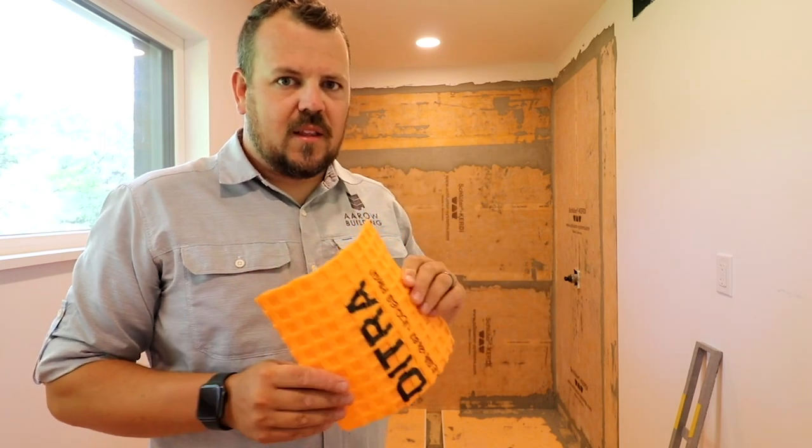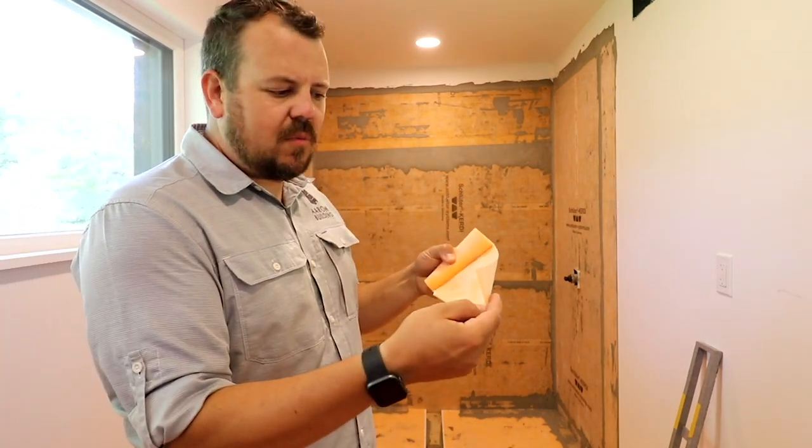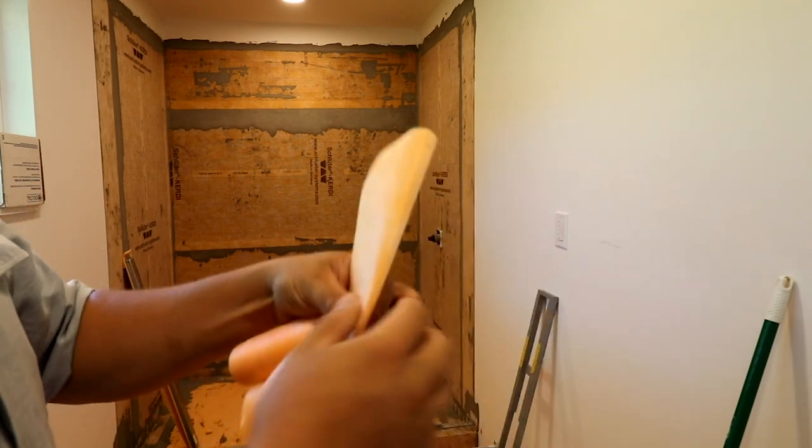Another really cool thing is that we're able to install the DITRA, then take some of their KERDI membrane banding, band all the seams, turn the product 90 degrees in the corner, and now we've waterproofed our bathroom floor. Literally, the water would have to run out of the shower, off the toilet, or out of a sink and make its way all the way to the doorway before we have an issue. Up until that point it could just be vacuumed up — it's on top of waterproof tile. That's been a game changer because we can push HVAC out of the floor, caulk down toilets, and have a zero-entry shower with no concern.